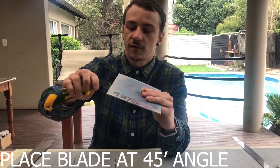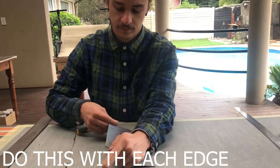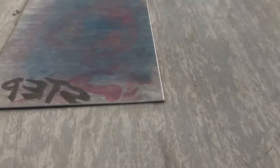Now that your plate is straight and square, what happens sometimes is from the pressure of the blade cutting, the edge of the plate gets a little lip on it. So what I do is take the blade at a 45 degree angle and just scrape the edge of the plate. You don't want to go too much — you're not beveling the plates to the edge, you're just taking the little burrs off from cutting.